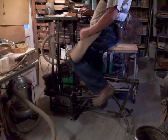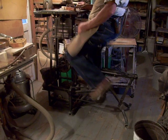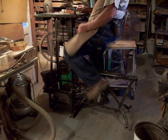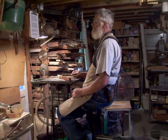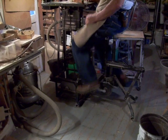This is to show my foot-powered table saw in use. Now it might appear that I am pedaling backwards. If I want a bicycle, that would be the case, but this is a table saw and to cut properly the blade has to turn toward you to cut. I have found one advantage to pedaling in this manner is that I don't have as much upper body movement as I have when I pedal as on a bicycle.